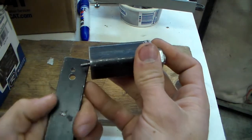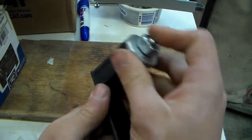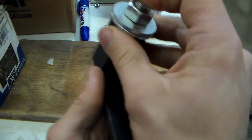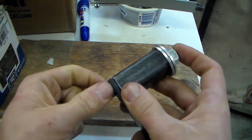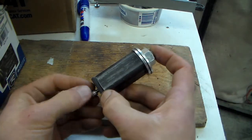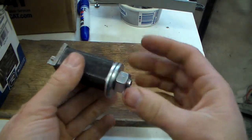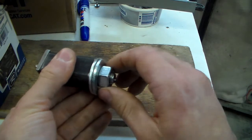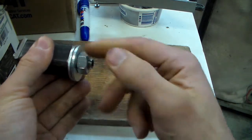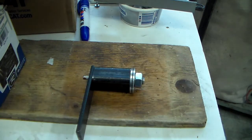This is a pusher plate, drilled just the right size for the bolt. Put a nice thread on the rivnut like this, then push it in the hole. Wrench number one holds the square tubing, wrench number two spins this nut and it pulls the rivnut in place. That's it.